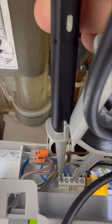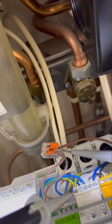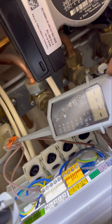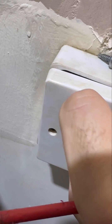Checking with the voltage tester and we're getting no power into the boiler. You've got the live coming in that way and down to the condense pump — checking that with the voltage tester and we're getting no power to the condense pump either. So the voltage pen was telling us porkies. We're going to check the fuse.